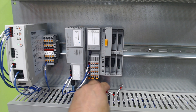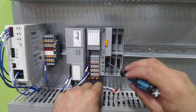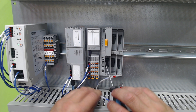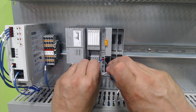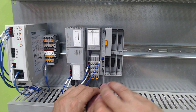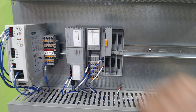The smart element, since it's not a push-in spring cage, we're actually going to need a screwdriver. If you'll notice, it says U plus and U negative. So we're going to hook this up to the positive, and then hook this up to the negative. The top and bottom don't matter — they're internally the same.